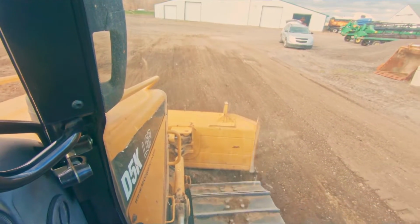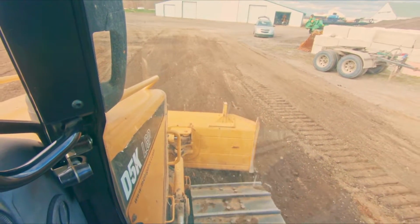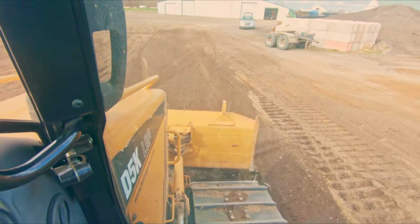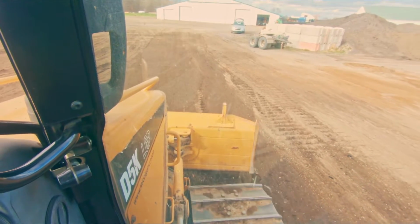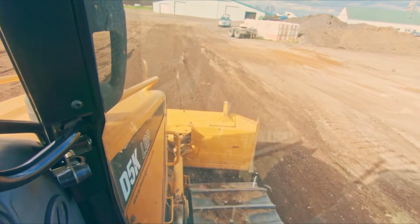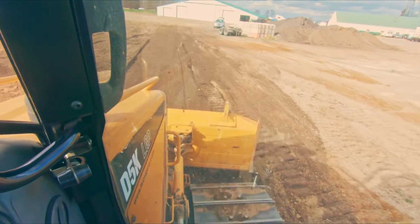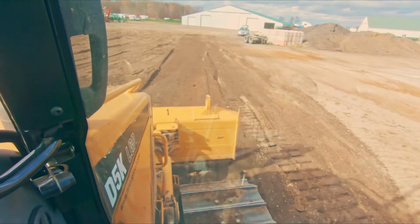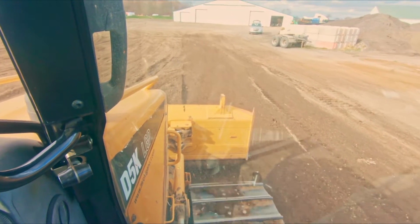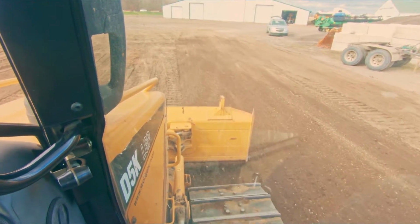So you don't get a windrow off of the right side here, I'm actually angling to where the right side is just a hair higher than the left. And I'm talking like a half inch, maybe a quarter inch. It's a very, very slight height difference. And what that's gonna do is, instead of the windrow coming out around the blade, it's allowing that material to run out, which is gonna give me a nice blended edge to my last pass. Right there. You can't really tell where my last pass stopped and the new pass started.